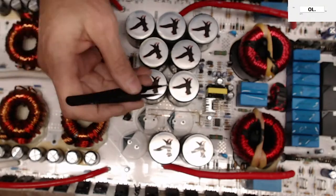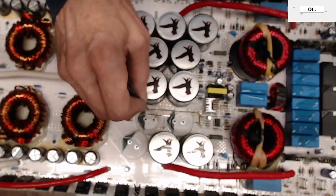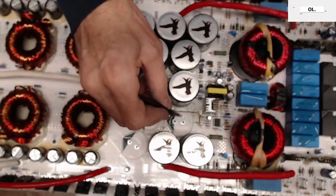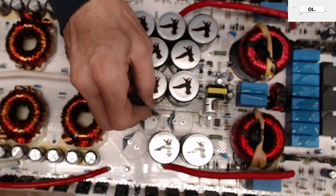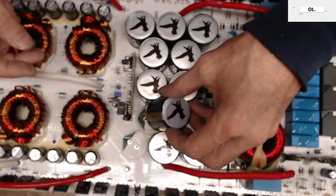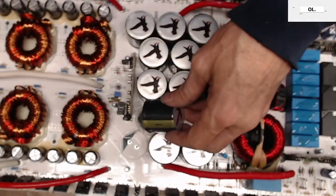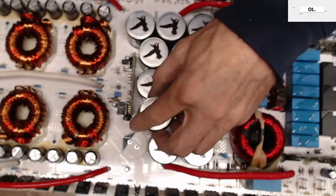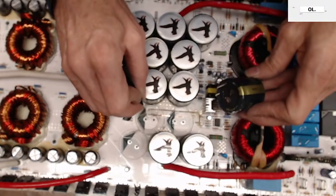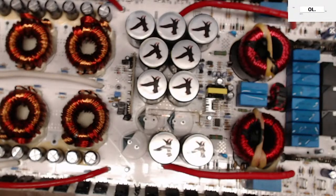Funny, this. These traces are the rails. What happens is it looks like it shorted out the positive and negative rail directly, because one of these goes to one main rail and the other via goes to the other main rail. So positive and negative. Once this capacitor wore through these traces here, it shorted the negative to the positive trace. Ah, there we are. How funny is that? Good job there, guys. Sure did. The negative side here shorted out to this trace, which via goes to the positive side of the capacitor behind it. Yep, that was a dead short across the rails.